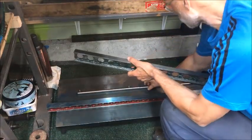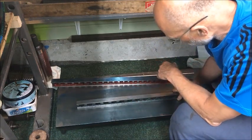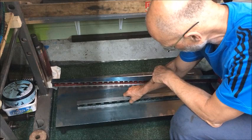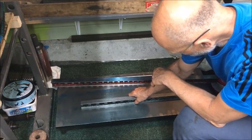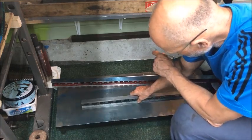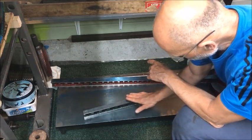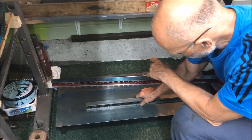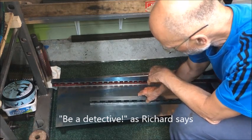Sorry for the awkward angle here, but I wanted to emphasize that you can get different results if you have this hollow in the middle. If you place a somewhat shorter straight edge on and prove it all right at a certain spot because it conforms, you can scrape it so that it won't conform the same way in another position. So it should be a telltale sign — just pay attention, and if your print doesn't match from session to session when you don't put it in exactly the same spot, check the plate.